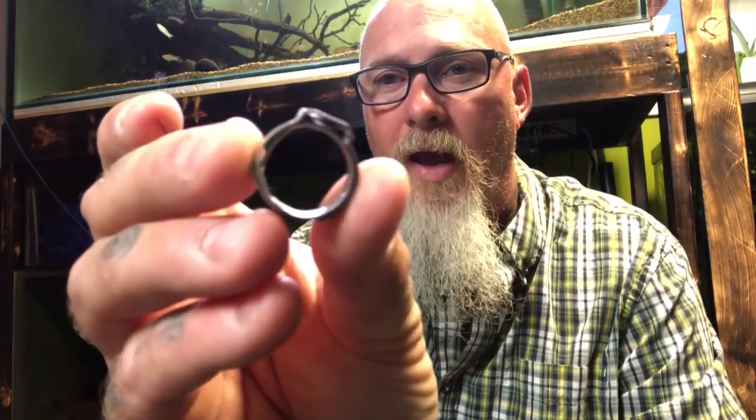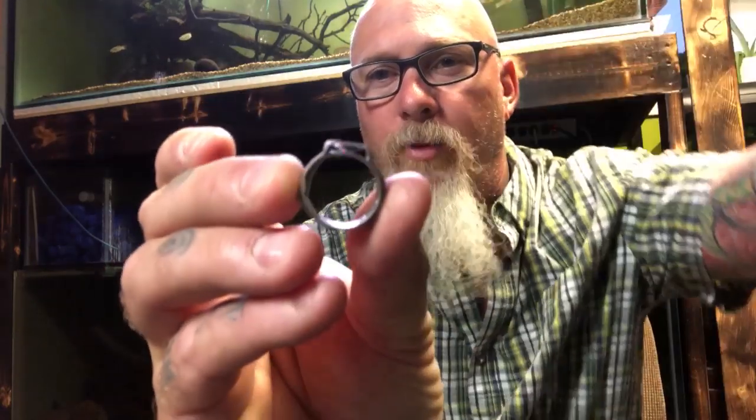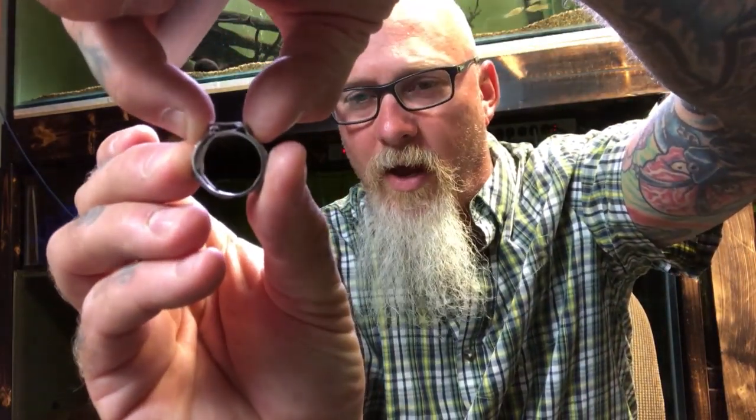Now, when you're gonna use PEX hose, you're gonna need different fittings. Maybe I don't need a union fitting like this for this project, but I just wanna use this to show you guys how quick and easy it is to put together, okay? Then you need the little collars. This little collar is the type of collar that is designed for these pliers, okay? I take the collar and put it in line on the fitting. You'll see the collar has a little head to it. The pliers are gonna come and grab this little portion of the head, and they're gonna squeeze it, and it's gonna make it real tight.